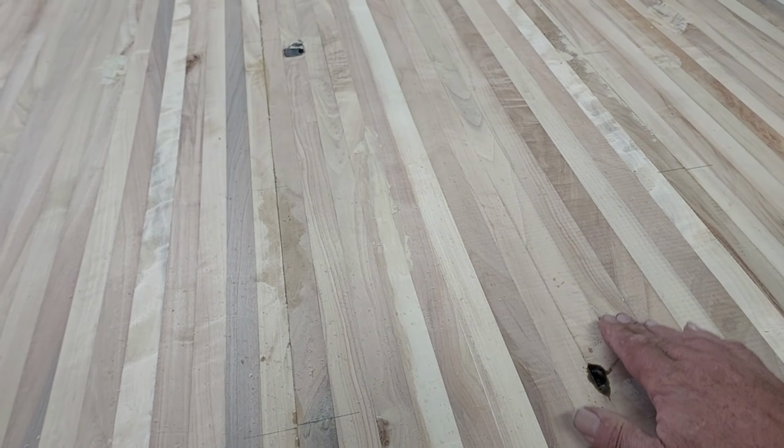Guys, that's the Rubio Monocoat done. One coat. I've left it for a few minutes and then wiped it off, and I also have done all the edges. And now I can just leave her and see how she dries. Then I'll see. Maybe I'll give it a quick scuff with a Scotch-Brite pad and then give it another coat. But let's leave it a few days and see how she ends up.